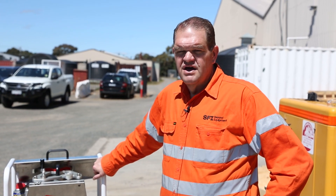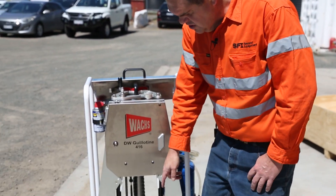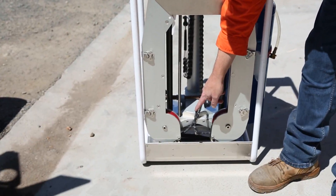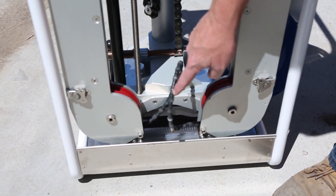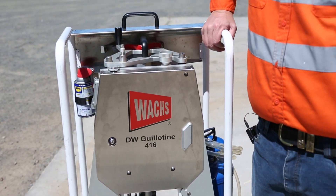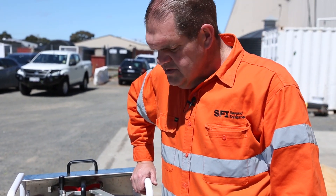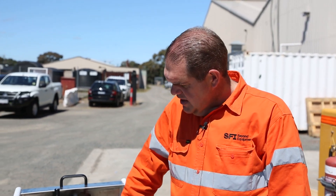It's very safe and it's a quick cutting performance. It uses a diamond wire — this is the diamond wire down here, and these are the diamond segments you can see here. They're all separated by about 20mm of the little helicoils underneath the rubber. The diamonds do the cutting and these helicoils keep the diamonds apart as they go around. As the wire wears, the little helicoils come off, which is an indicator that your wire has worn.